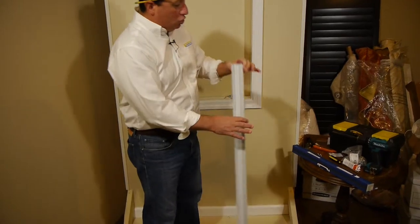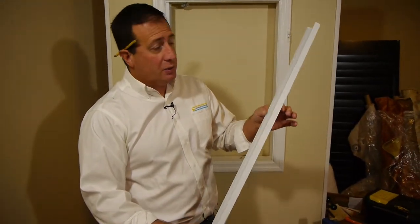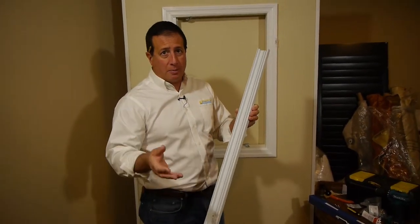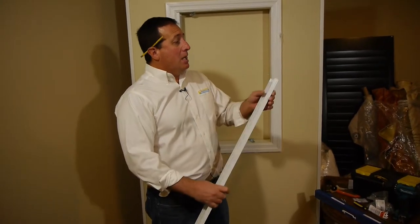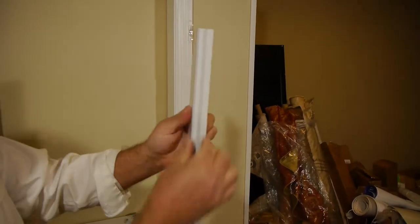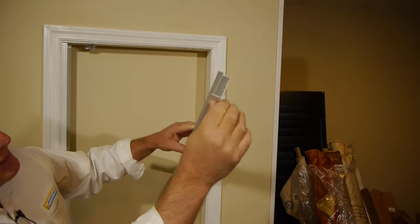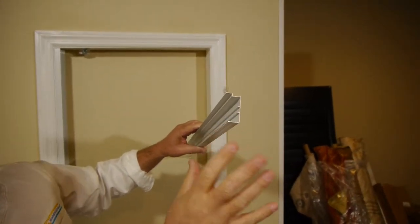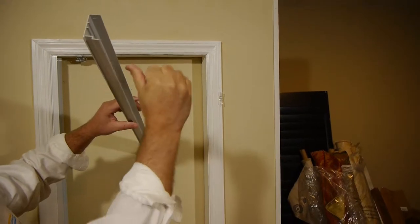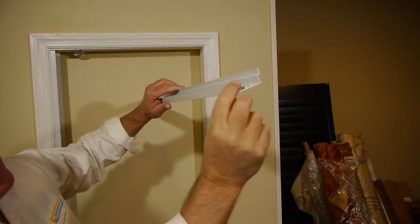You're also going to receive two aluminum side rails — no plastic, everything we sell is top shelf. They're all going to be painted white regardless of what color skylight you order; blue, brown, or purple, your rails are always going to be white. If you look closely at the rail, you'll see there's two sides: the thin smooth side and the tapered wider side. The smooth side always faces down into the room for a clean look. If your skylight is a little out of square and needs a bigger lip, you can reverse it and use the larger lip to accommodate. If your measurements are tight, keep the small side down.